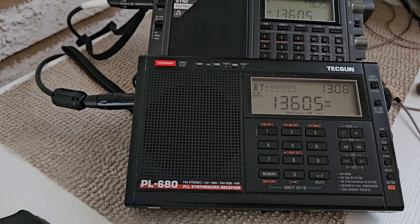I posted some videos on this channel of me doing some experimentation with a secondary MLA-30 active antenna that I modified with a three-foot copper loop. I've been testing it in various directions — north, south, east, west, southeast, northwest, that type of thing. One thing I wanted to show you is that in my discovery, I've noticed that some of the frequencies that are normally locked on to their transmitting frequency are five kilohertz off.